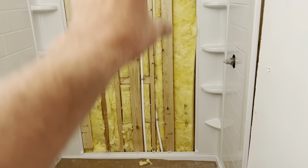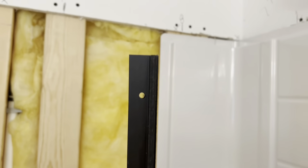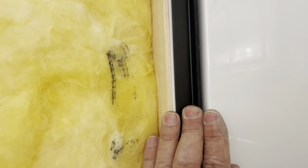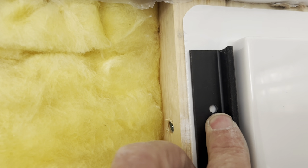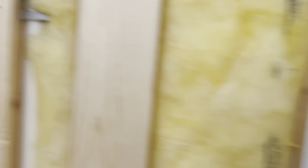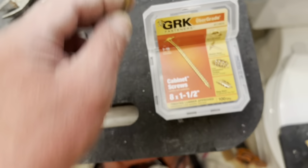I still need to put OSB on the back wall before we're ready to glue. There's also a connector track that has to be installed - here's the connector strip, which I don't think is described very well in the instructions. I'm going to show you the connector strip, which took me reading the instructions five times to figure out. It goes on here and they recommend using GRK screws - flat GRK cabinet fasteners - to pilot drill and place the screw in. The back panel will then snap in over all of this. The homeowner was kind enough to go buy the GRK screws - that's the type of screw they want you to use.